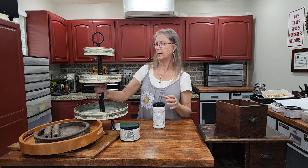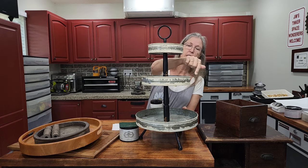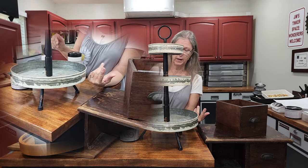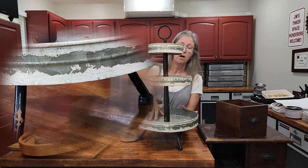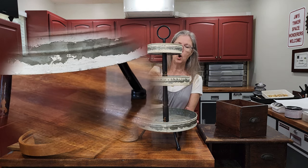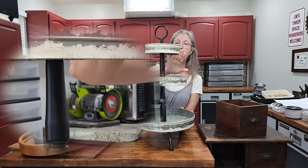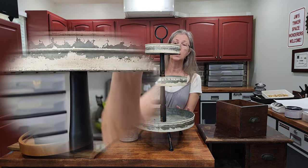This piece, when I start to work on it, has lots of crackling because of the finish that was put on here — lots of broken pieces of paint, chipped and peeled. It was intentional when it was finished this way, but it needs a lot of repair and has damage on it. When I want to start painting this, I need to get all of this smooth, so I'm going to need to sand it smooth. Do I need to sand it all back down to the galvanized metal? No. But I do need to get it to where there's none of this chippiness, because when I apply the paint, that chippiness is all going to show, and it's going to look like you tried to put lipstick on a pig.